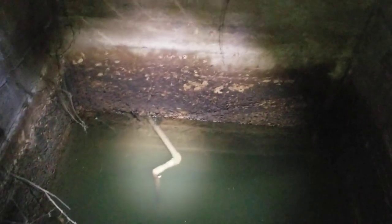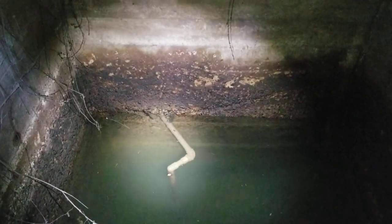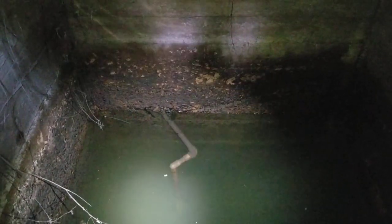Inside, it's just a hole in the ground with water in it. Now, you see that pipe? That pipe leads to the well pit — that's what the pump actually pumps out of — and then it goes into a pressure tank and supplies water to the barn.